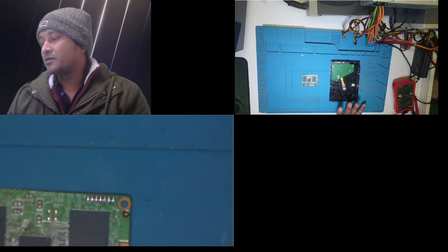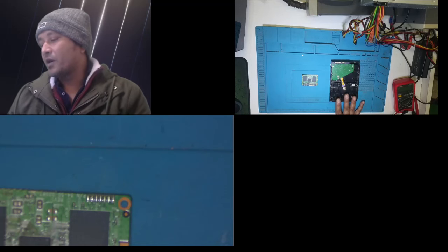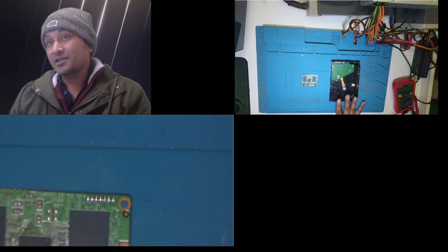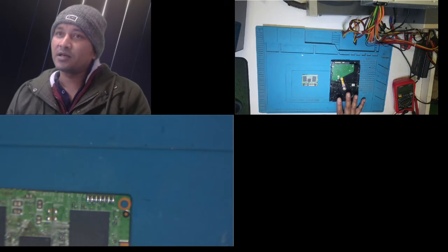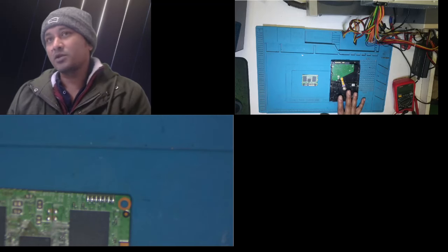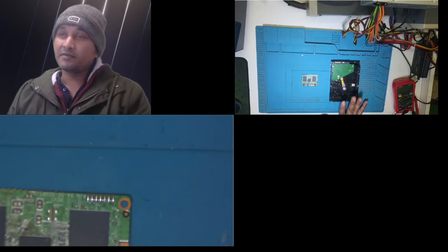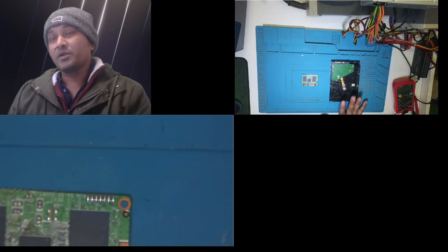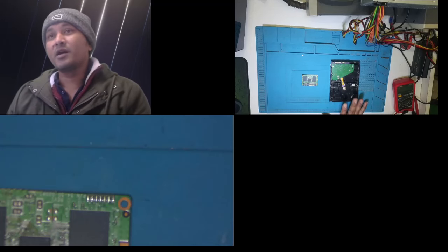I recently, actually 3 weeks back, bought a new RTX 3080 graphics card. Before, I was using a GTX 1070. I got a second hand RTX 3080, actually not a brand new one. The price was right, so I took it. Now to use that with my old PSU, that was a 750 watt but non-rated. The GTX 1070 was alright with that PSU. I never had a problem, but when I put in the RTX 3080, it was giving me a blue screen every now and then.